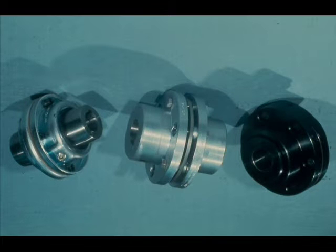This segment of our course deals with three types of flexible couplings, including how they work and the nomenclature of their parts. The three types we're talking about are the gear, grid, and disc couplings.